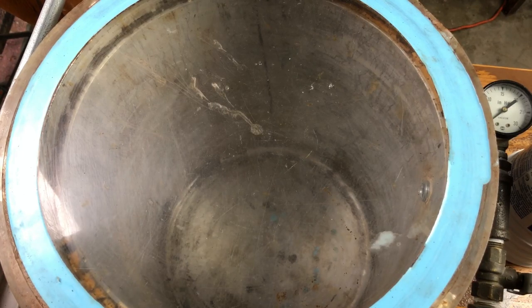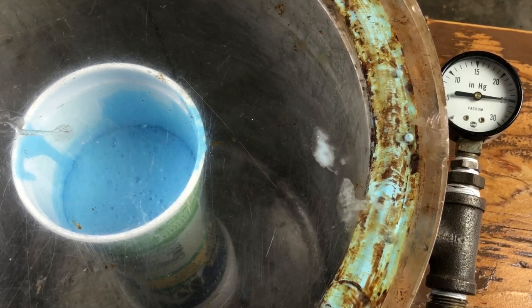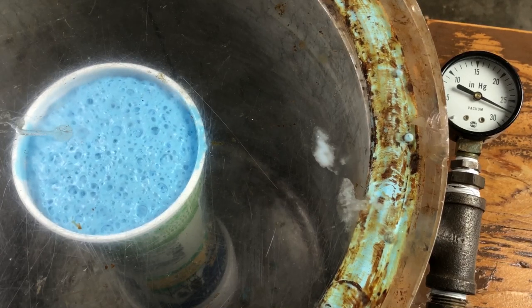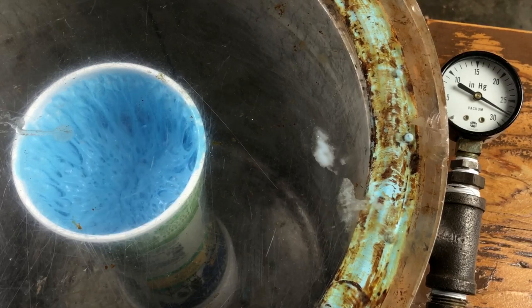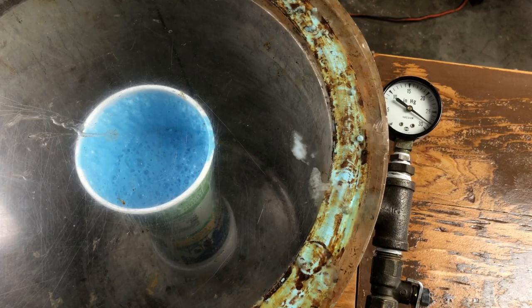We're at the vacuum pump — let's fire it up. You can see the valve pulling the vat, going up slowly. It's going up and you can start to see material rising. If I did this right, it will not overflow the cup — it'll come right up to the edge. Just stand back and admire the genius. I've done this enough times that I know you can put exactly 330 grams into one of that size and it won't overflow the cup. But you do have to have a lot of space in your cup, otherwise the rubber will overflow and make a mess of your tank.